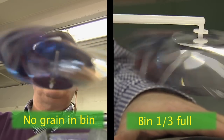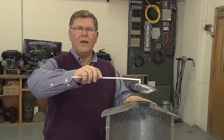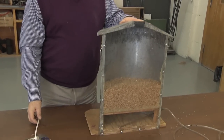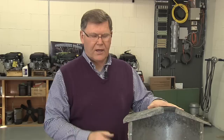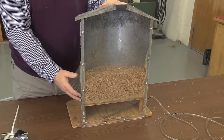We've still got quite a bit of airflow, but we can tell that the pinwheel has slowed down. That's what we would expect — as static pressure increases, the amount of airflow the fan can deliver decreases. We saw a fairly quick change in static pressure, going from just the floor at a little over a quarter of an inch up to three-quarters of an inch with a shallow layer. We get static pressure or resistance to airflow depending on two things: grain depth and the velocity of air going through that depth. Here we've got a shallow depth but high velocity, so we're seeing high static pressure.